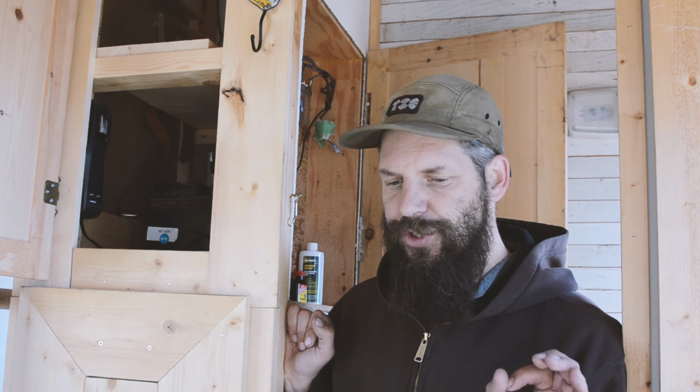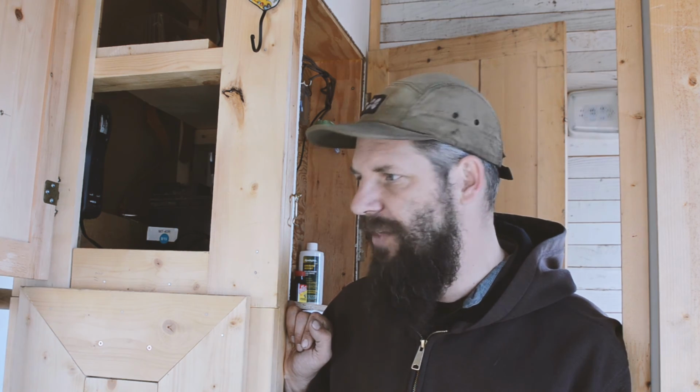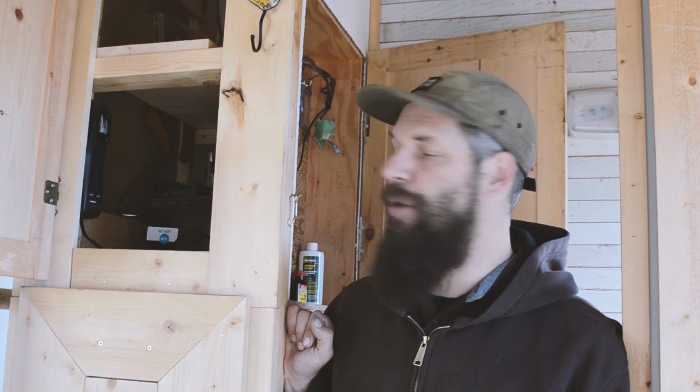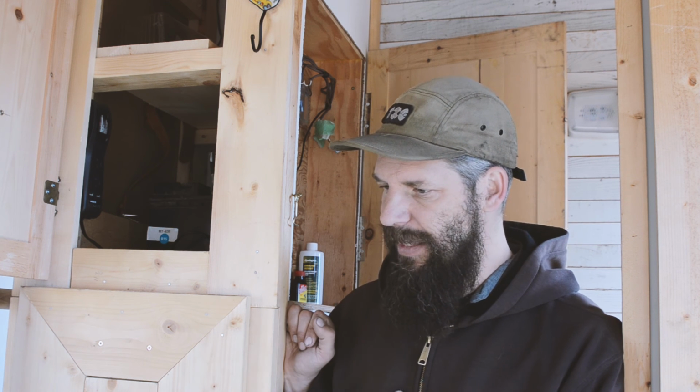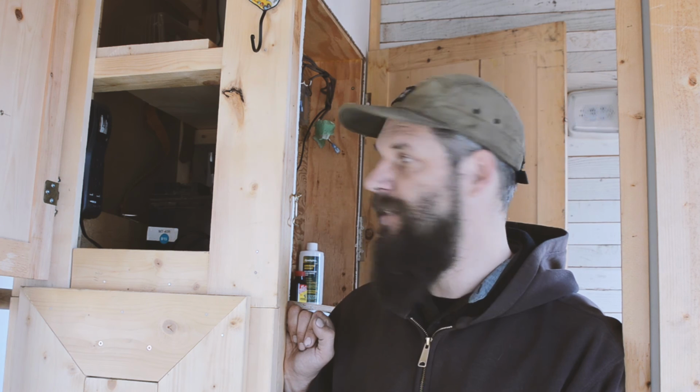The third stage of stuff that I'd like to do today is just add the same kind of charging ports, a 12-volt cigarette plug port, as well as a couple of USB ports to the wall on the other side where the bench is, where the bed is. Because really that's where I want to plug things in. I want to be able to plug my phone in over there in the living space, as opposed to having to come over here all the time to check if it's charged or not. Adding a couple of USB ports is not such a bad idea. And then the cigarette adapter port will allow us to plug in a number of different devices. We've got a little 12-volt vacuum we can put on there and some other things.